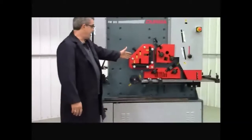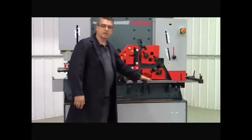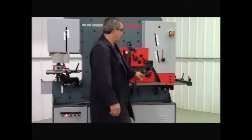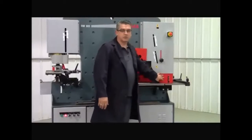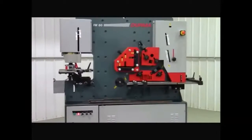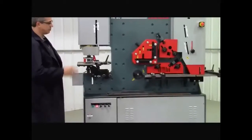You've got a 5 by 5 by half angle shear. You've got an 18 inch bar shear that will do 18 inches of 5 eighths or 12 inches of 3 quarter. Your coper notcher, or rectangular notcher, is 2 by 3 and a half and it'll do 15/32nds which is just under half an inch. The round and square bar shear is inch and 3 quarter max for both round and square.